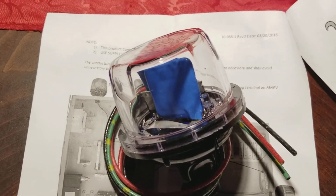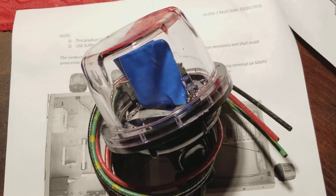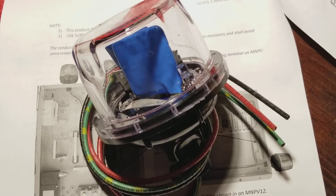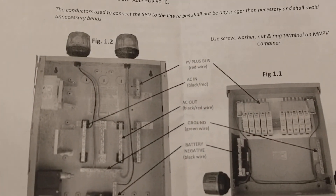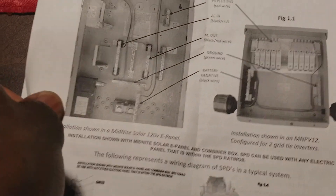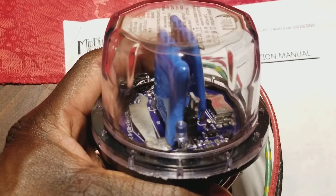Leave the house ground rod by itself — don't use it to ground your solar equipment. Ground your solar modules on a separate ground rod and your equipment separately. If you're feeding power to your house, that's fine, but your batteries must also be grounded by taking the negative to the ground rod. That's how your system gets grounded properly. This device works on both AC and DC. I hope you find this video informative and helpful. Don't forget to subscribe — this is JW Solar USA. Thanks for watching. Let's go solar!